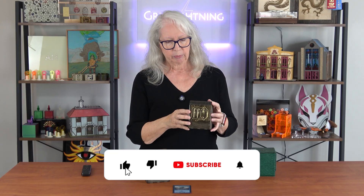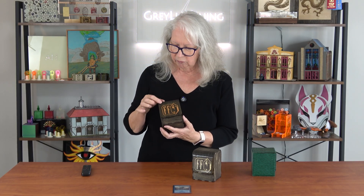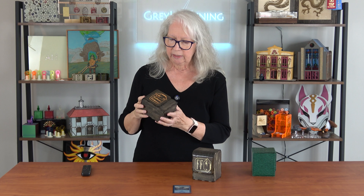The problem I had with the prototype is that this is an inlay — a very light-colored inlay on the dark stain. I thought I would protect it with clear UV resin and applied a coat, but after the resin was down the inlay released a lot of tiny little bubbles which didn't go away and made it foggy. So that was not a good finishing technique. What I did on the final version was change the color of the inlay to a reddish color, then put masking tape over the hinge and apply several coats of triple thick glaze sprayed on — that's enough to protect it and gives a very nice finish.